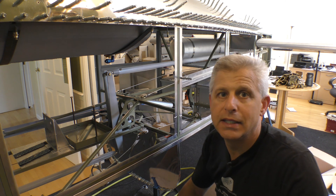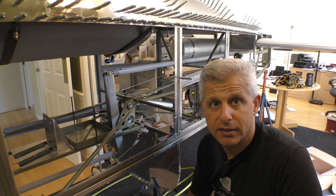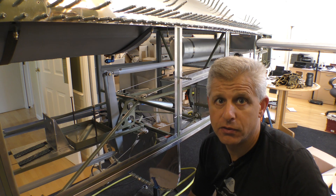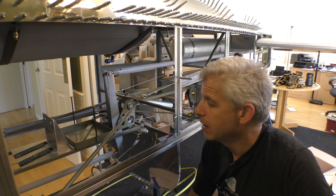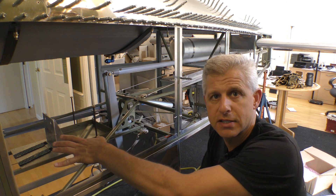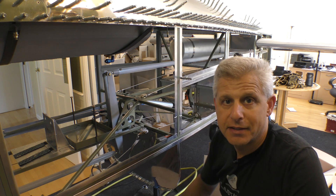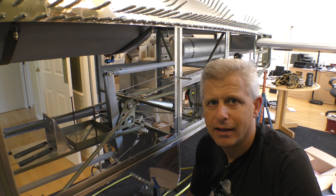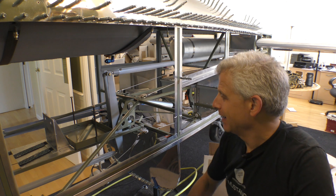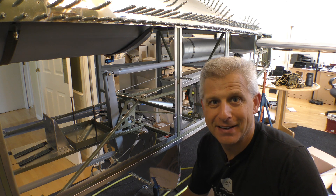Once the shelf is in place, it's really easy to mount the pump, and we can use it for other things as well. As we get to work on the electrical system, it opens up the forward area and makes it easier to use that space for solenoids and other controls. So it kind of isolates things — we'll have the electrical system up front and the hydraulic system in back, and just run lines in between. Let's measure, get the tubing cut, and I'm going to try MIG welding for the first time using my new Lincoln Electric MP210.